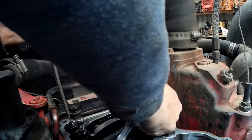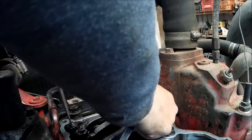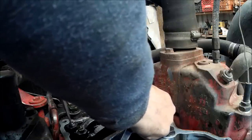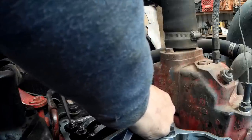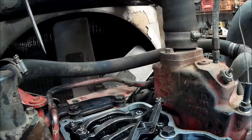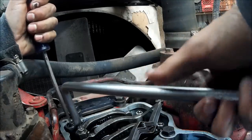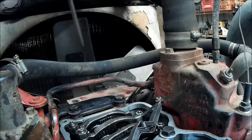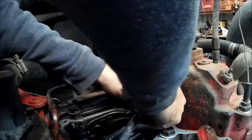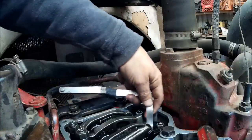Everything on a small cam can be bolted. Basically all your accessories, if you wanted to swap this out to be a big cam, everything on the front of that motor would bolt onto the big cam. And I don't know, it may go all the way up to like the low flow big cam fours. Which if you did that, you'd have to have a different radiator, but the big cam four can be converted over to high flow. Makes for a better engine.